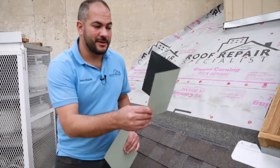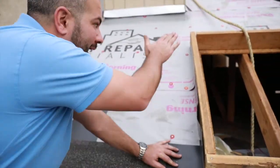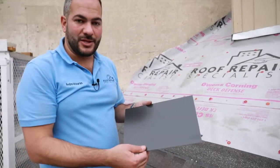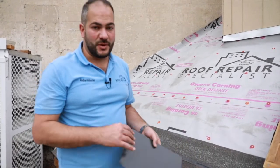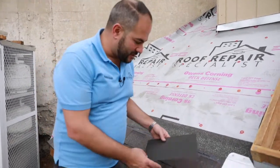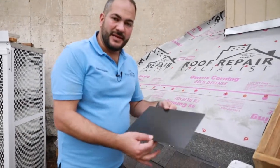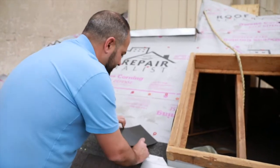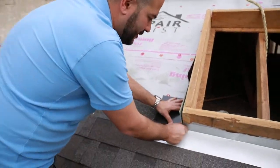Step flashing is essentially a piece of flashing bent to a 90-degree angle — we install one piece of step flashing, then install a shingle, and this steps up like so. What we use to make step flashing is what we call tin shingles — these are 8-inch by 12-inch square pieces of metal. They come pre-painted as well as just galvanized. We generally like to go with pre-painted step flashing to match the roof as close as possible. These are pretty easy to bend by hand and don't need to be a perfect bend because this is going to be all covered up.